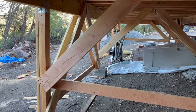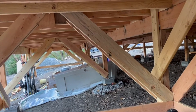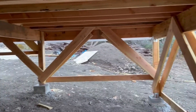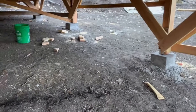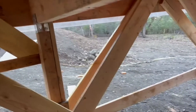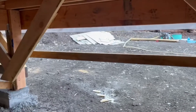The plus side of a post and pier foundation, especially in earthquake country where I'm at, is that it will buckle a little bit, which is fine as long as it doesn't break — and wood is good for that. This is another corner of the house where we might do a root cellar. I'm actually right underneath the kitchen right now, and we have big dreams of doing a spiral staircase down into a room here for cold storage eventually. Some of the braces are right across from each other and some of them are just not, because I wanted to get as much span and as much grip as I could.